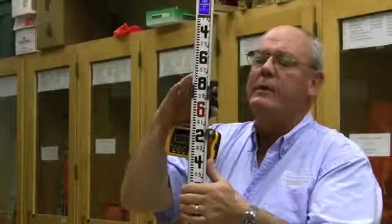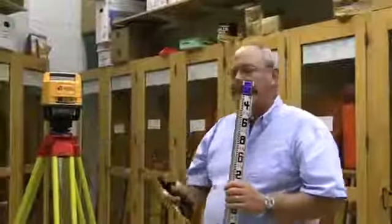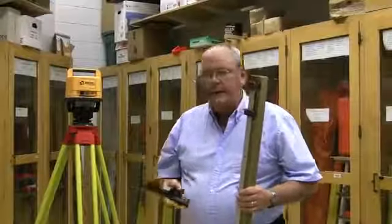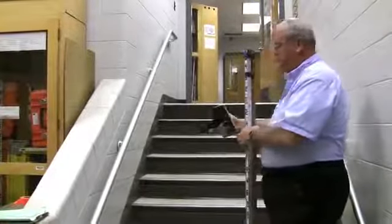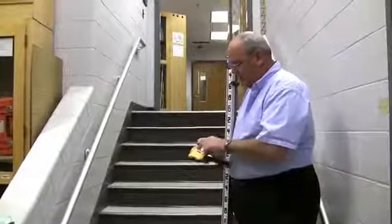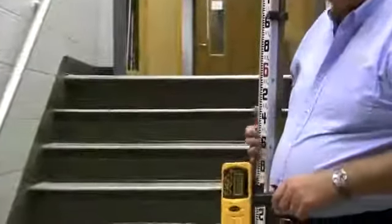The rods will simply go up and down, and then we have a sensor. This sensor reads the beam of light. So the laser is working, and I'm going to come over here to our known elevation 100.00. I'm going to turn this on, and then I'm going to mute it a little bit so that it's not too noisy.